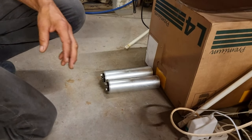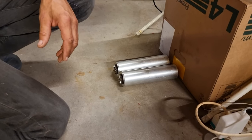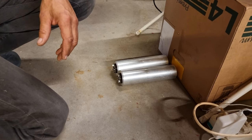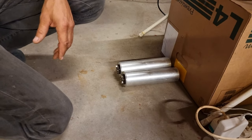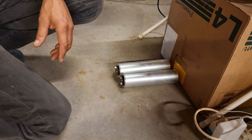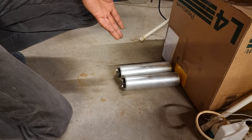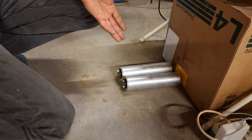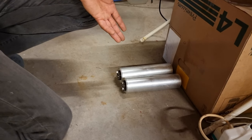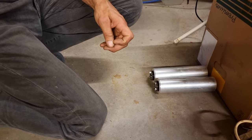And then you have some resistors in there. What kind of resistors are you using, and what kind of specifics? No resistors at all, actually. Okay, some big diodes, rather, sorry. Yes, diodes are being used, of course, in the Cockcroft-Walton. These diodes are very simple, because they need to handle maybe 400 volts and one or two amps, so these are very cheap, simple diodes.